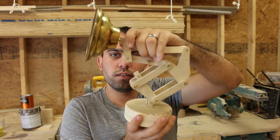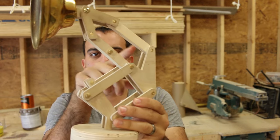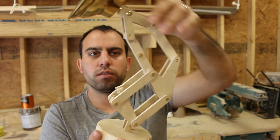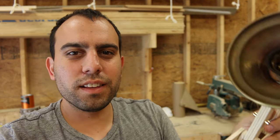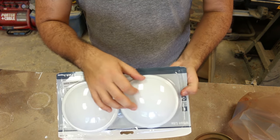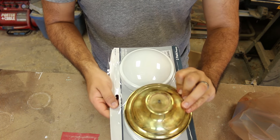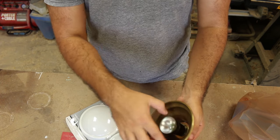Here is the progress so far. My plan was to add springs to make this a true balanced arm lamp, but it is working so well with friction right now I don't think I want to really mess with that. It might be because of the humidity that the joints are swelling, but it feels really solid. Someone used up the last of my spray lacquer without telling me so I've got to run to the store. I got these little puck lights that have a white diffusion material that almost perfectly fits around the outside, so I'm hoping to pop one of these out and somehow use it inside this ridge.